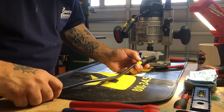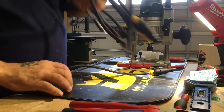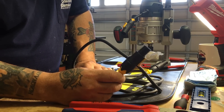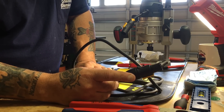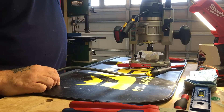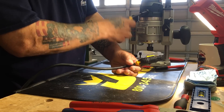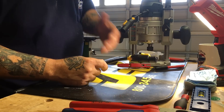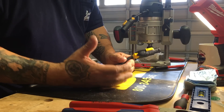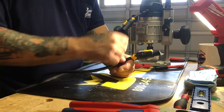This is 14 AWG 2-conductor; the one I made the other day is 18 AWG 2-conductor. This 14 AWG is good for about 20 amps — the Colt router that came with the 18 AWG cord is only 5.6 amps, while this router is 15 amps. If you're going to buy a bunch of males, you really only need one female — make the cord off your biggest draw, which is this router. You can use a bigger cord on smaller amps but not a smaller cord on bigger amps.